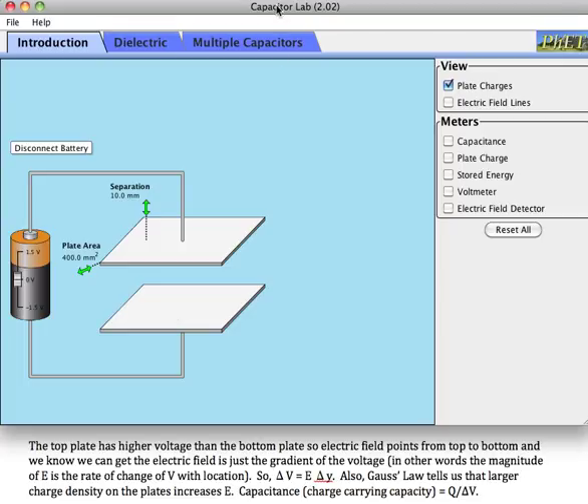This is a schematic picture of a battery. The details of what goes on in a battery are appropriate for a chemistry class — we are not going to spend time on those details, other than to say that there are at least two chemical reactions that happen. One of the chemical reactions ends up spitting out electrons at the negative terminal of the battery, and another chemical reaction gobbles up electrons from the positive side. So electrons are being shoved onto this wire here, and being taken from the top. That's what a battery does.